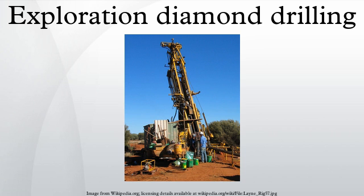If the rock were always solid granite and the core would always break at the drill bit, it would be a simple matter to stop the drilling and lower a simple grabbing device by a wire and pull up the core. Unfortunately, many applications require an undisturbed core in fractured rock, which calls for elaborate wire line devices. The photo shows the extraction of a core using a triple tube wire line system, capable of extracting core under the worst conditions. This is very important when exploring fault zones such as the San Andreas Fault.